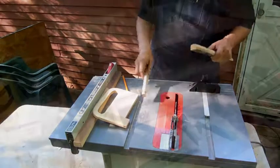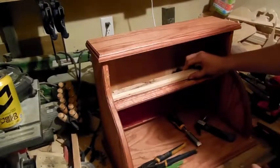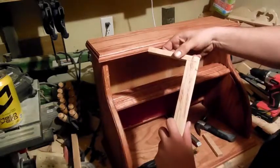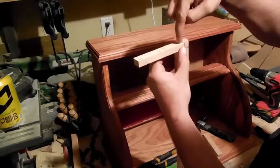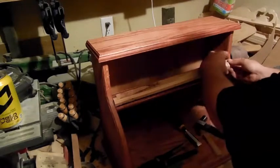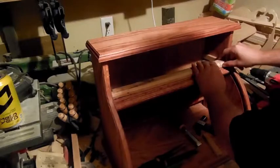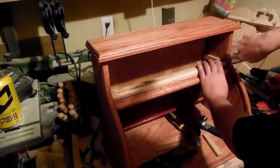And there she is. So what I've got going on here — this is going to sit in here like so. These are the two runners that I cut. As I was showing before, these will fit in here. I'm going to glue and nail down through here to hold these in place, and then these will fit in this way for my drawer to slide on. The front drawer face is going to sit flush in here, just back past this edge a little bit.